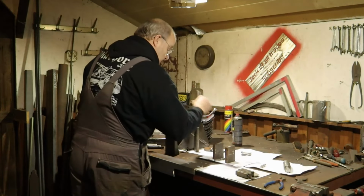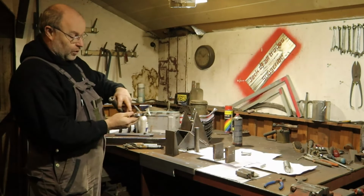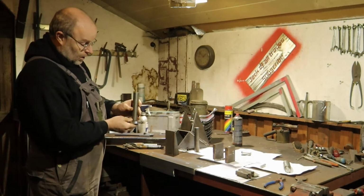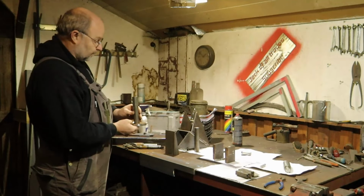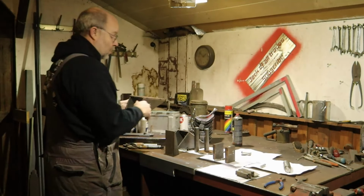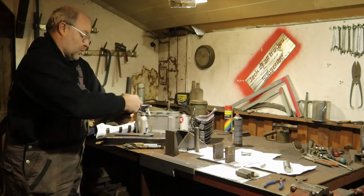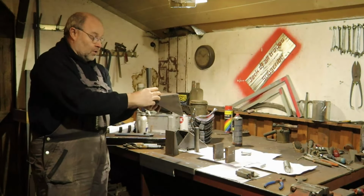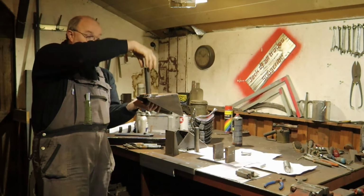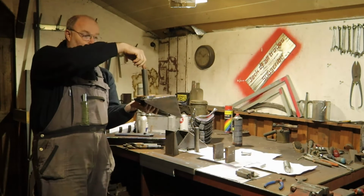And we have these parts, so we have two discs. I've tack welded them together so I can drill the holes more easily. I only have to drill 4 holes now instead of 8 holes. Later on this will be welded together and then mounted to this bracket. So like this, so also have to drill the holes in here. Sorry, wrong way around. So like this will also be welded to the hull, and the mounting bracket for the MG34 will go on this, and then will bolt down on here.